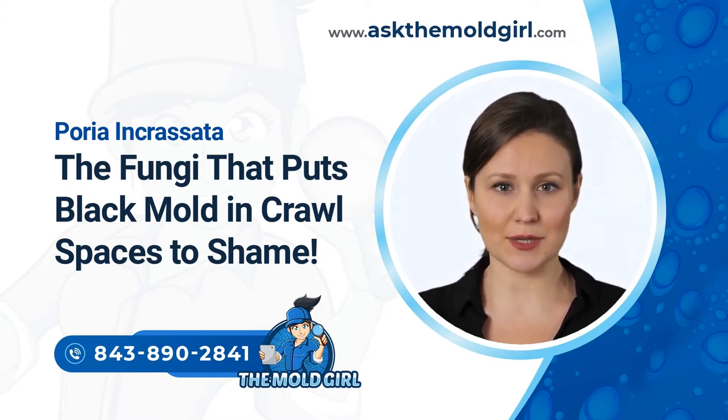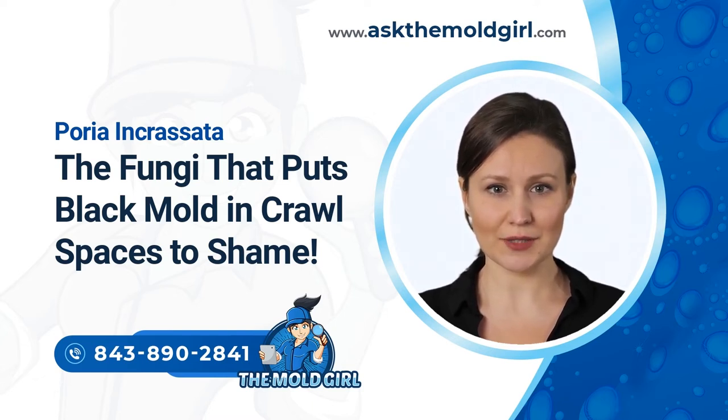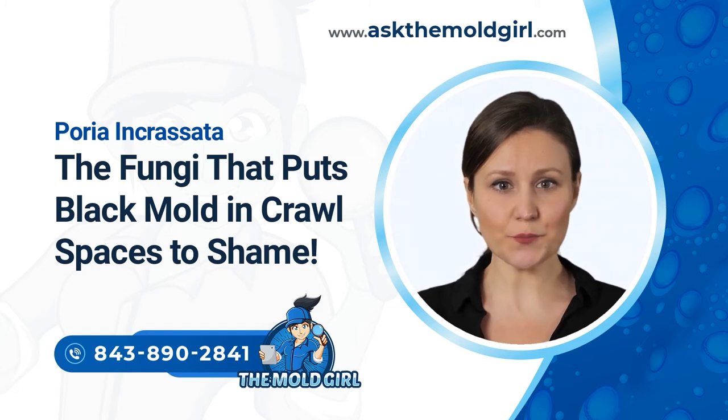Given its unique water-conducting abilities, lack of moisture or water won't stop the fungus from thriving in a basement. Poria's occurrence isn't any different — the fungus occurs naturally to aid decomposition. However, the origins of poria in the US aren't clear since the fungus has only been a problem for a few decades. According to Wayne Wilcox, a forestry professor, the fungus originated from soil used for landscaping that was sourced from various forests globally where poria is a naturally occurring fungus. His theory is derived from the premise that the initial houses in America found with poria had all undergone major landscaping two years before poria's onset.